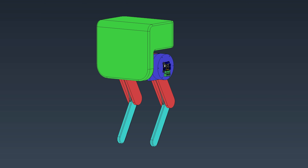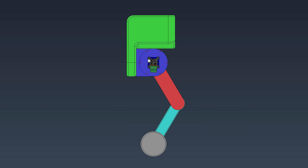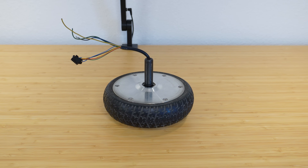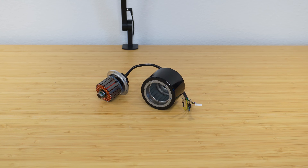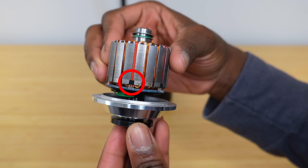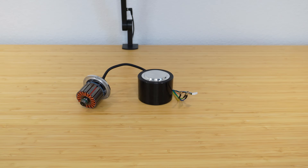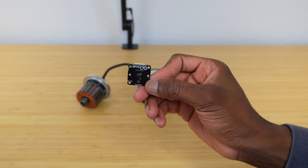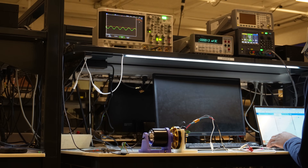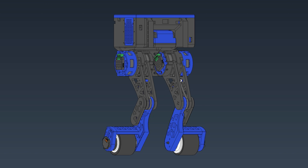Just like the walking biped, the wheeled biped is going to have six actuators, but instead of adduction actuators it's going to have wheel feet. You can think of the robot as a Segway with legs. My first thought for the wheeled feet was to use old hoverboard motors, but they're pretty heavy and overpowered for this application, so I'm going to use electric skateboard hub motors instead. If you open one up, you'll find three hall effect sensors embedded in the stator — used for position feedback — but they only provide six degrees of angular resolution, which is horrible for robotics. Luckily I have a 12-bit magnetic encoder with 0.09 degrees of angular resolution, so we'll use that instead. Just like before, I'm determining the KV and the stall torque of the motor, and after spending several more weeks redesigning the robot, let's build it!